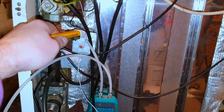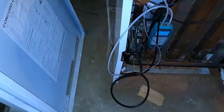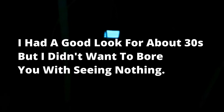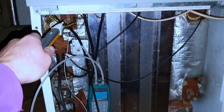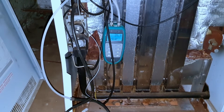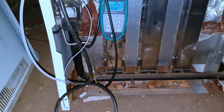There we go — sparking. The fact that we can hear it sparking... oh, I thought it lit there. It may just be a dirty pilot. Let me get this part cleaned and I'll get this HT lead rerouted so it isn't running across metal. I think I've done this previously and maybe someone's been here in the meantime, because I wouldn't leave an HT lead like that.